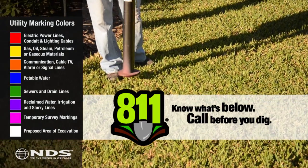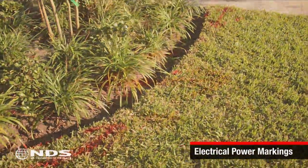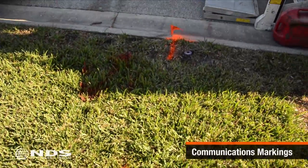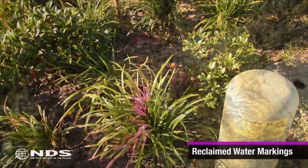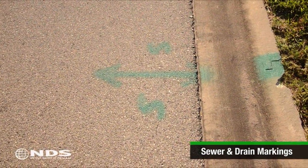The first step is preparing for installation. Before starting any kind of digging, be sure you know what's underneath the areas to be dug up. In most areas, calling 8-1-1 will get you to the right folks who can come out and mark the location of utility lines on your property, as shown in this clip. You can also call the local utility to have them come out. Be sure to call cable, water, sewer, storm, gas, phone, and electric.